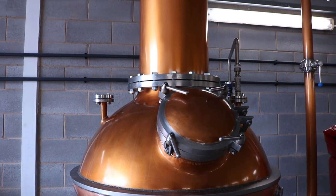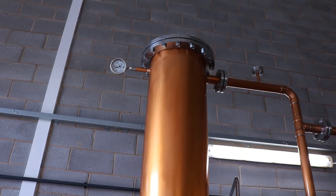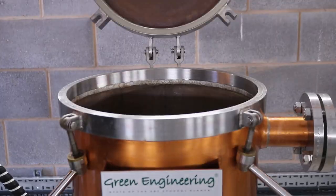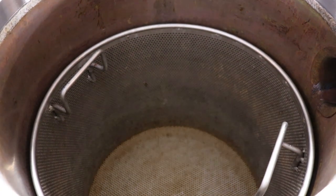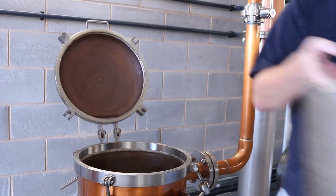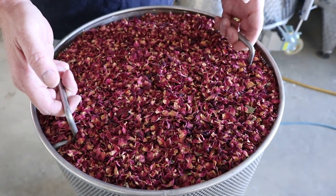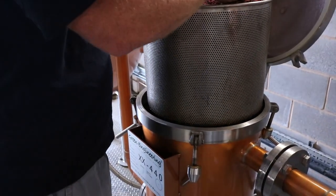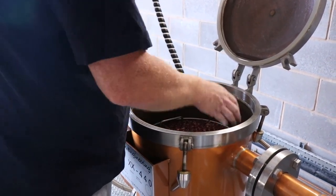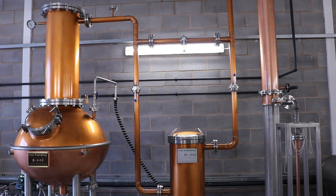While Clara is heating up, we turn our attention to the botanicals. Many distilleries add their botanicals directly into the still, but at the Surrey Copper Distillery we use what's called an infuser basket. The botanicals are weighed out and placed in a strictly controlled order into a metal mesh basket to ensure the perfect gin is made. The predominantly alcohol-based vapour that Clara produces passes through the botanicals in the infuser basket, picking up all those incredible flavours and fragrances along the way. This process produces gins with a very smooth character.